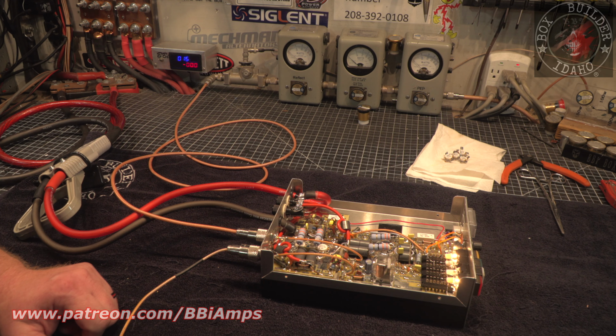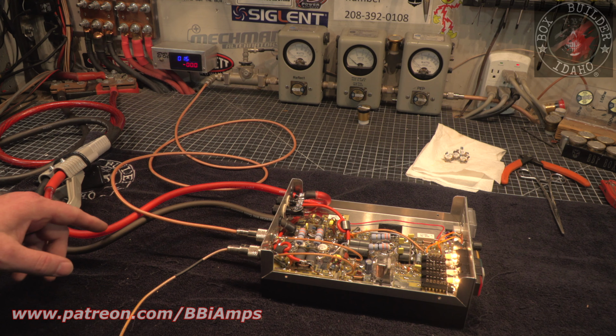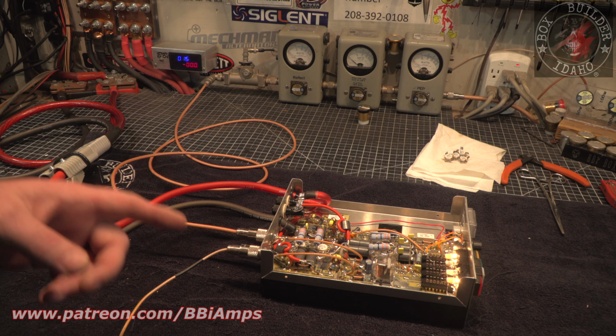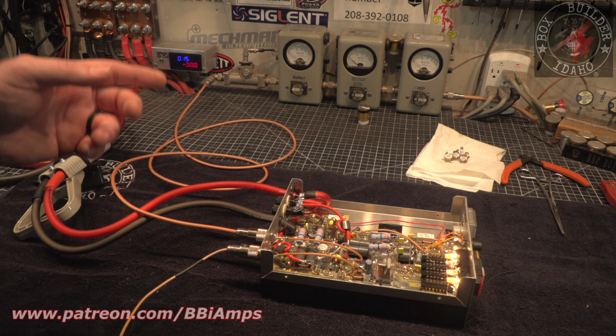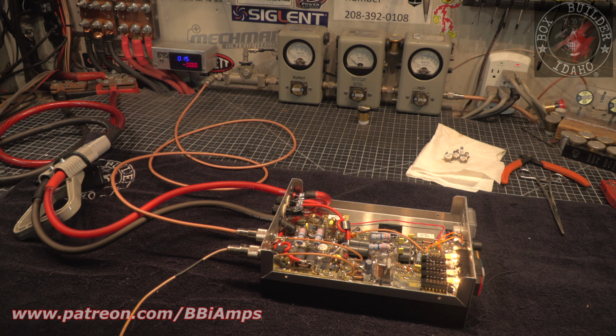you've got like 12 gauge coming out of the amp, you might want to think about feeding that with 8. Or, maybe you got 8 gauge coming out of the amp, you might want to think about feeding it with 4. Because there's so much line loss between the battery and the amplifier. So you want the maximum performance out of your amp, get it the most amperage that it can possibly drink. And it helps keep the voltage up. It's kind of an Ohm's law kind of thing.